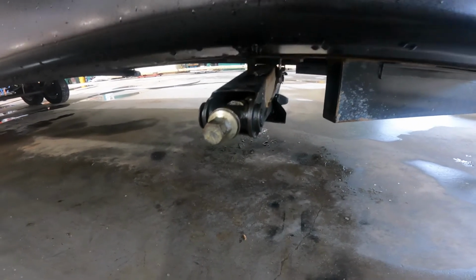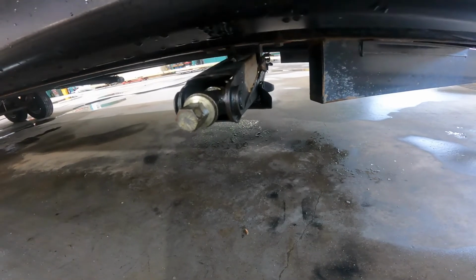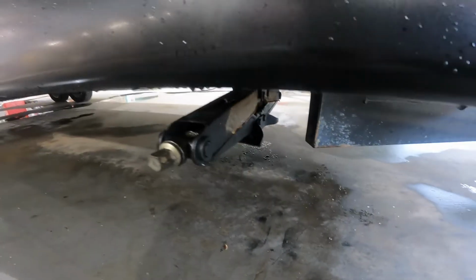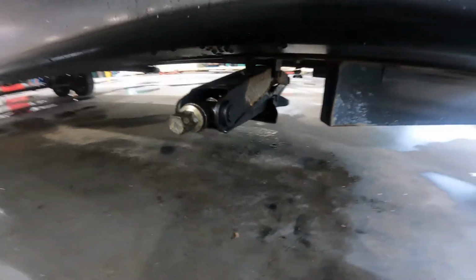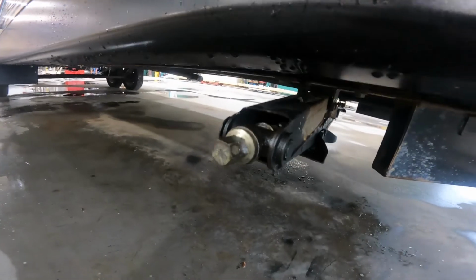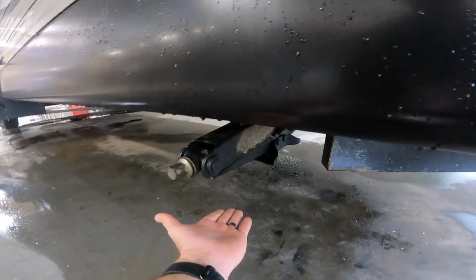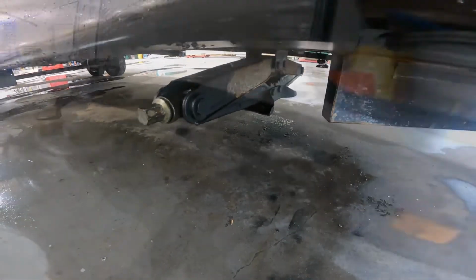These stabilization jacks are located at the 4 corners of the trailer and should be used to snug the trailer up to the ground, never to level the RV. Once the RV is mostly level, you bring these down so they make contact with the ground and prevent excess movement of the trailer. You may require some blocking in order for the jacks to make contact with the ground. My recommendation would be 6x6 blocks.